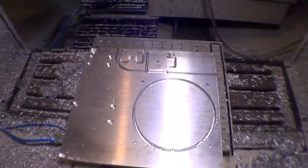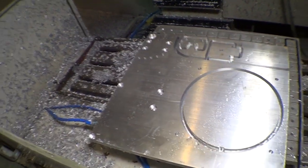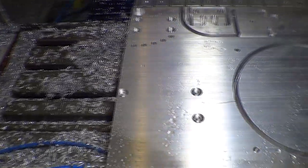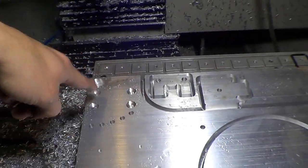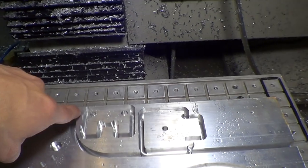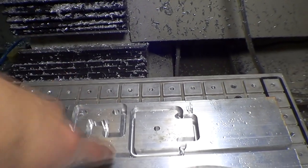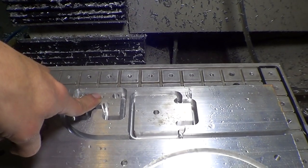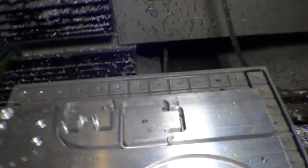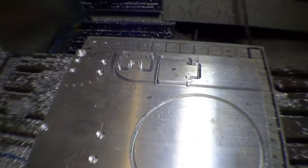This is the main body of the grinder — the main motor plate. This piece comes out, bolt holes, brackets — this is part of the tilt up-and-down mechanism. I cut away a section I didn't need, but I was able to make two extra brackets from that material for the tracking adjustment knob, rather than wasting it. While it's all fixtured up I make those brackets and save some material. That turned out really good.